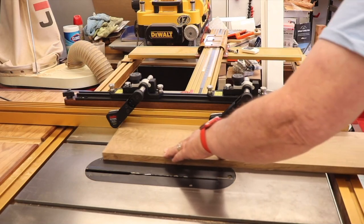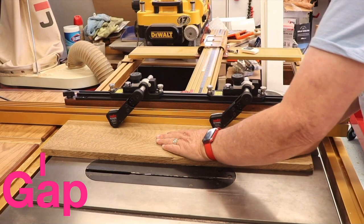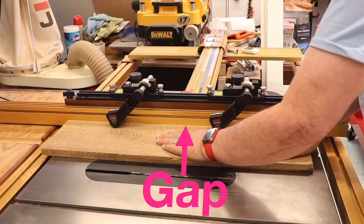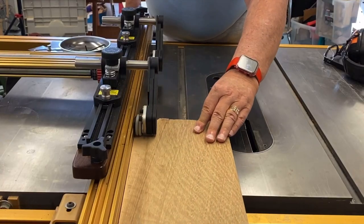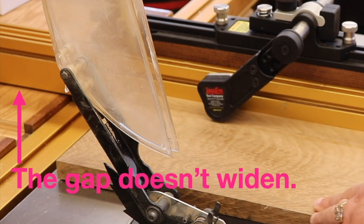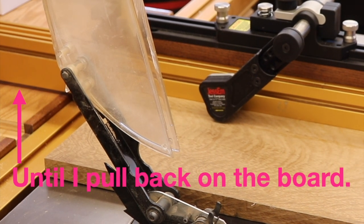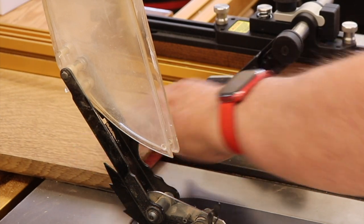Let's look at that section of video — and you can see how that popped up. I stopped the video here so you can see the gap between the outfeed table and the fence. As I switch out the photo, you can see what the gap was like just before I made that last push. The gap obviously got bigger, but not by very much. As the video starts up, you'll see the gap widened again. In order to get it loose, I have to push it all the way through. I found another video segment to show better what's happening. Notice as the board goes under the second guide, the gap does not widen. But the gap does widen when I pull back on the board to show how the guides are holding it. As I push the board forward, notice the fence goes back down. When ripping a board, this shouldn't be a problem.